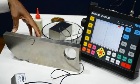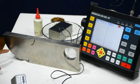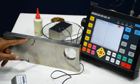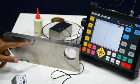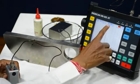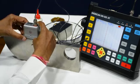Now for this calibration of the angular probe we have to do the setting on this IIW block. This is the center, and the arc — the radius from the center to this arc is 100mm. So we are sending the pulse from this location to this arc, so the beam path will be 100mm. Here we have to make the echo at 100mm — that is the calibration. We have taken the range 165, and now we will place this probe at this location and move forward and backward.